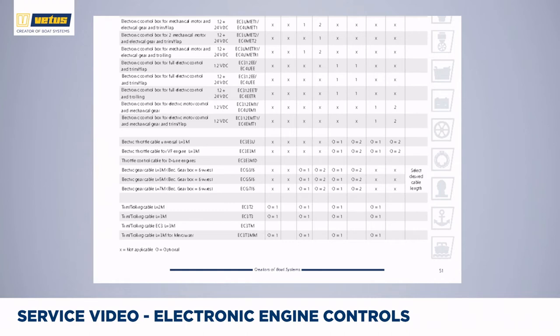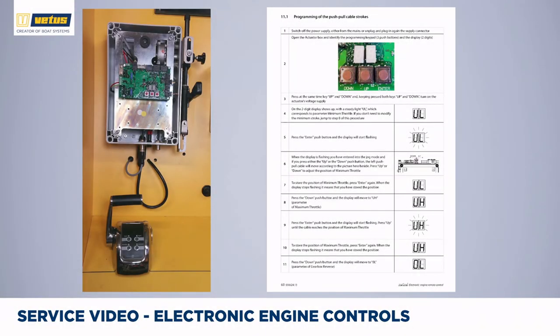When you have a partially or fully mechanically operated engine, you need a control box, also called an actuator box. This box translates the position of the gear lever on the dashboard to a lever on the right-hand side of the control box, which will move either the throttle and/or the gearbox into the correct position. One of the most important settings is the length of the stroke and the direction of the stroke. Before you do this, please make labels showing up and down as called in the manual, but also forward, neutral, and aft, which you can tape to the control box, as this is an area that can get very confusing very rapidly.